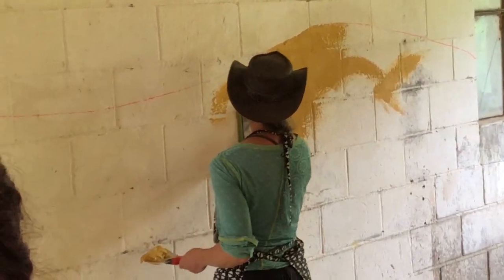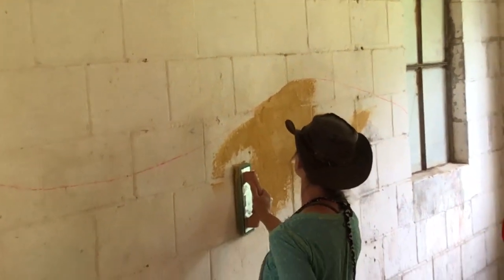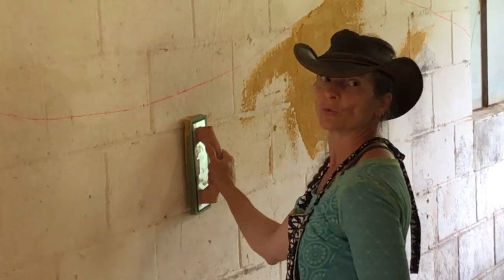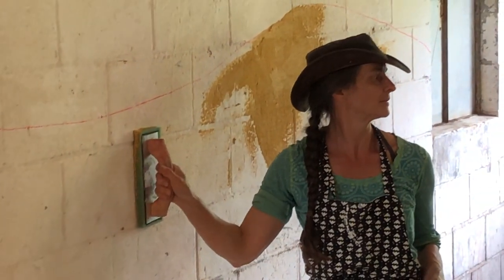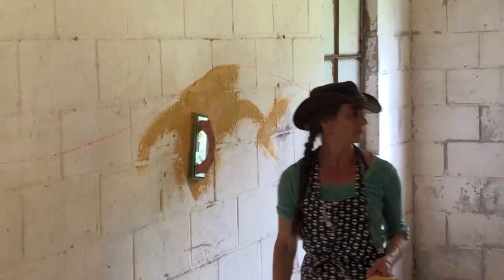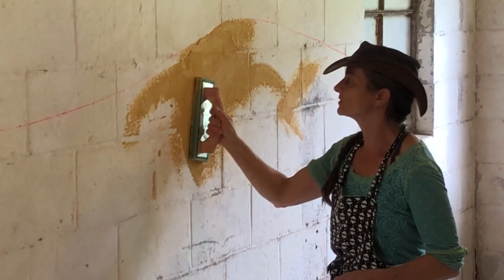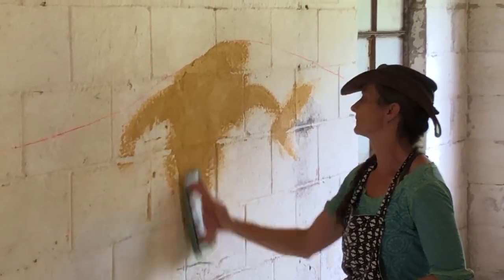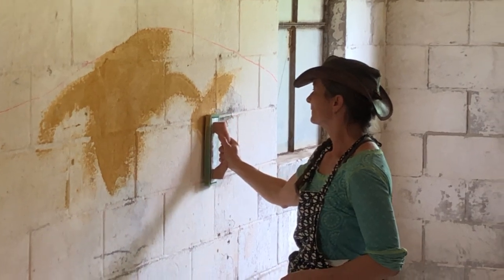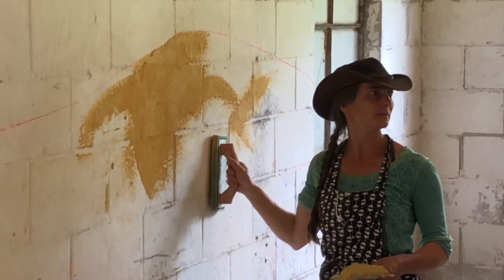When your float is more or less parallel to the wall, but the front corner is just lifted — you see that? The front edge is lifted so I can run in this direction. You are spreading the plaster onto the wall. If you're completely flat, you are attached to the wall and you will pull off as much as you put on. Picture an airplane: you're going to land with the nose up, stroke through, and take off with the nose up. As parallel as you can be, but with the nose up.